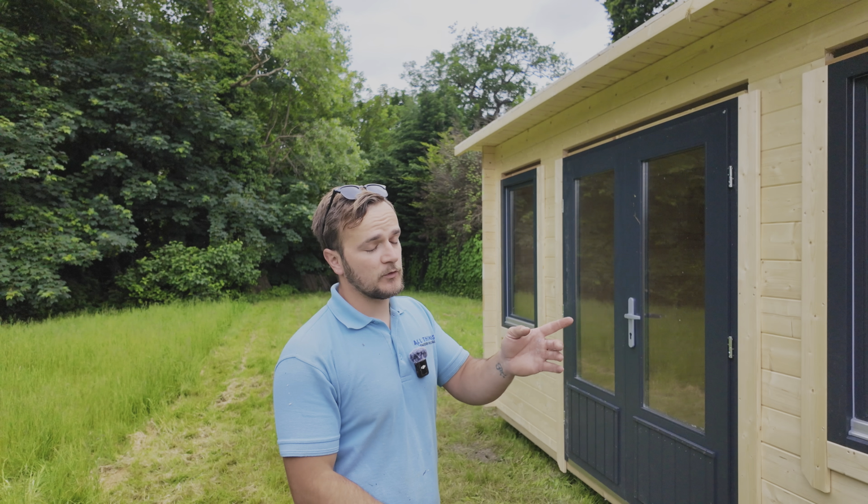So now Ben's finished boarding the roof, what I like to do is, when you look down the very front of the building, I like it to be lovely crisp and straight, because there's nothing worse walking up your garden path and you can just see a fascia board that was wonky in it. So what I like to do, we've got a predetermined 300mm overhang on the drawing. So what I like to do is just come back 10mm. Little pencil mark at this end. A little pencil mark at this end at 10mm. Same at the back.